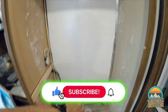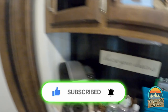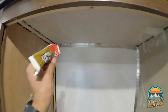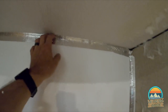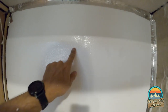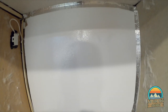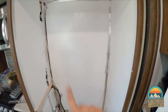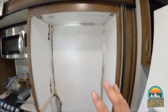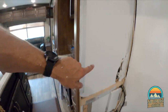Here's a quick update. I put a piece of foam board back there with the aluminum side facing the wall. I used liquid nails — just a couple of squiggly lines around the corner and an X in the middle — and then some foil tape up top to hold it. These boards come four by eight by one inch; I used two pieces instead of one to avoid having to piece the wall together.